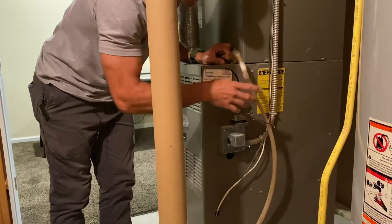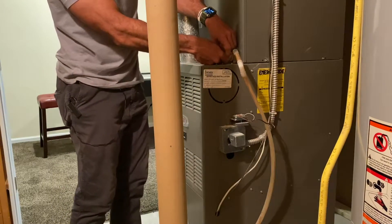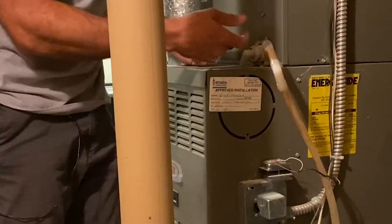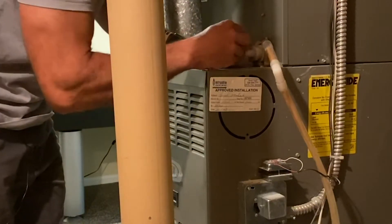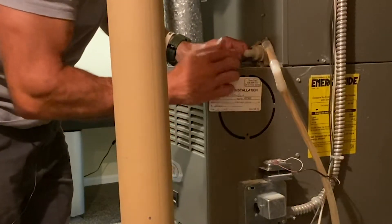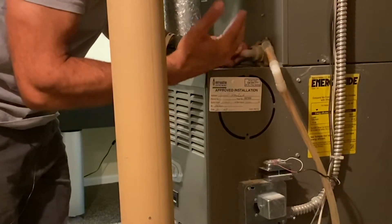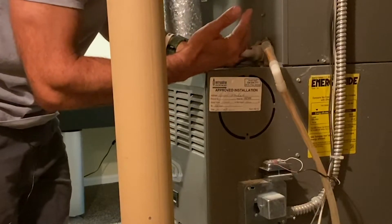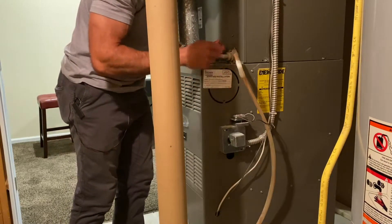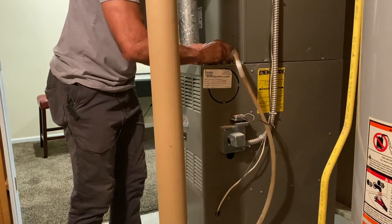Blow that out and make sure all your hose or line going down to your drain is cleared out. That might not always be the issue — sometimes this fitting here will have a clog in it. You're not always going to be able to unscrew this; sometimes you'll have PVC going through here or other types of drain configurations. With PVC it's going to be more difficult because you'll actually have to cut the PVC and then repair it. You might want to just call somebody to do that, and that's perfectly fine if you don't feel comfortable. But if it's just an easy one like this, you can try to unclog it yourself and save some money.